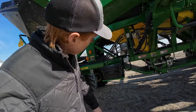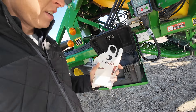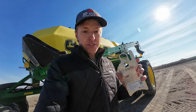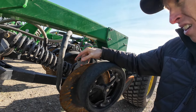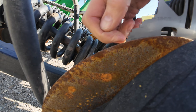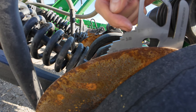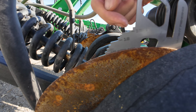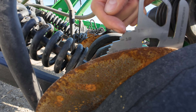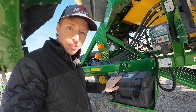In order to check your disc diameter, go to your handy box and open it up. Pull out your Ready drill inspection tool — this is going to tell you the diameter of the current status of your disc. Drop it on the disc hub. Right here we're seeing it's right around 17 inches. 18 is here — that's new. If you've got our 18 and 5/8, that's our most popular round disc. Our notched disc is about an 18 and a half average — the tip is about 19 tip to tip, but the average is about 18 and a half when you consider the troughs and the tips. Then just throw it back in the box so it's there for next time.